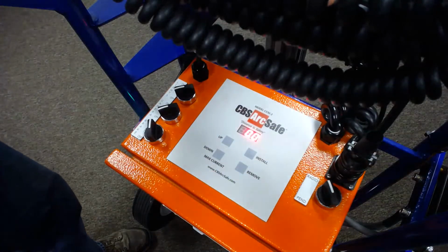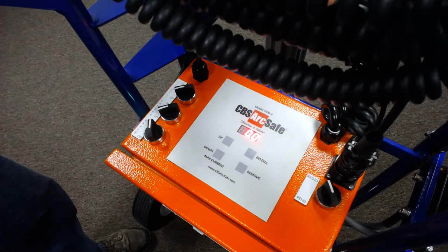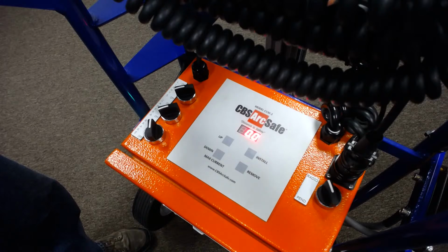If we're dealing with a 3000 amp breaker, we're going to need to move the number up. But these are mechanical systems in terms of a given mass, a given bus size, and you're going to have a certain amount of force that should be normal that you're going to see doing this. So these tend to be very repeatable. There are statistical outliers. We go over those with customers.